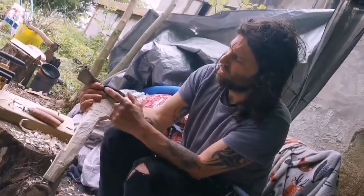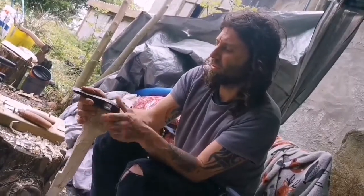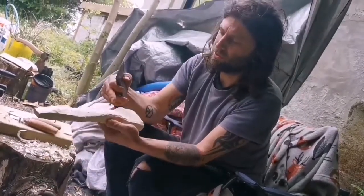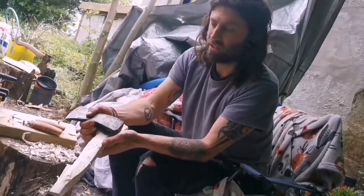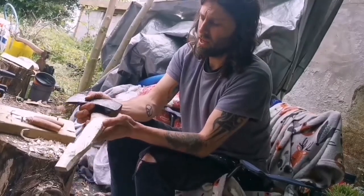And then all I've done is took note of, I mean, it needs quite a big shaft going through the inside. It's quite a heavy head. And also the thickness. So I'm always keeping it bigger than what it needs to be. So now all I want to start doing is carving the shape of the neck into the shape of the actual shaft that fits through the axe head. And then all I'll do is get it to a point where I can nearly fit it on.